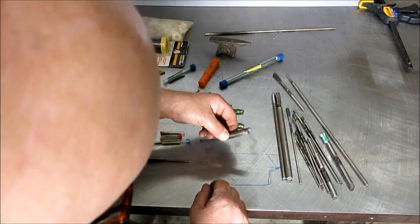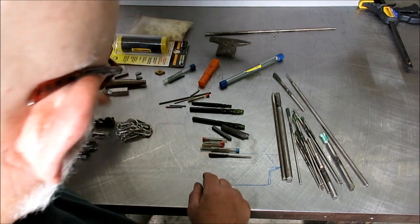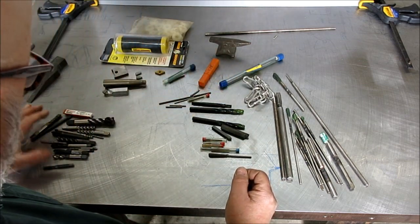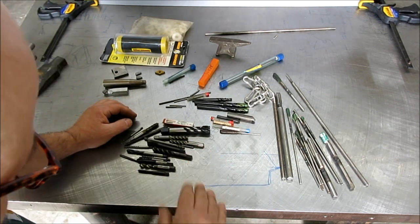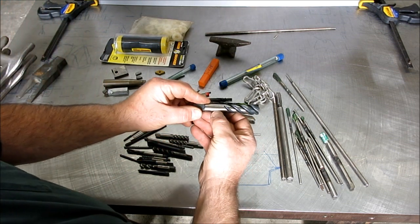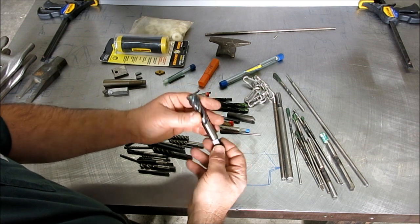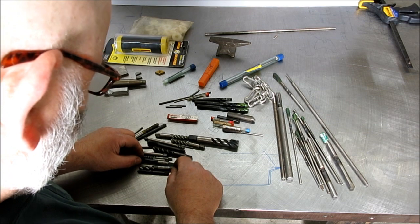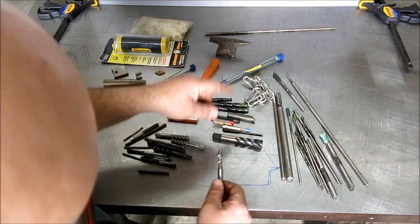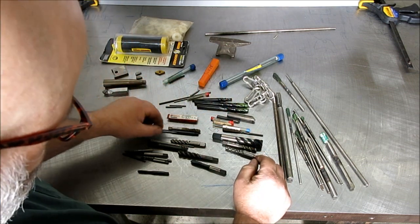There's some step drills in weird diameters, some kind of weird boring tool, another piece of carbide with a threading point, some little end mills and center drills — just an eclectic collection. Some hooks — who doesn't need a couple of those. And then there are some real nice taps. Some of these are helicoil taps. This is a real sweet tap — Greenfield EMSS. These kick butt in stainless. Absolutely kick butt in stainless — the way they're relieved and cut, they just work wonderfully. And there's an OSG one here — when you bury this one, the chips come out of the hole, they don't go in front of the tap. These all feel nice and sharp, they're pretty happy taps.